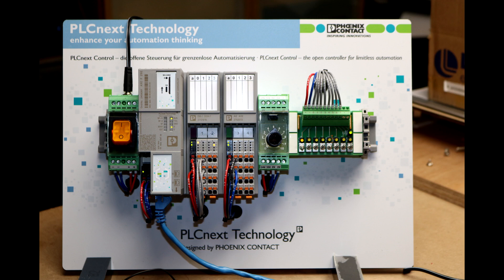We'll look at how to communicate with other products and even heterogeneous ones, such as Node-RED running on a Raspberry Pi, a Modbus HMI device, and a few other things. We'll also look at running the OPC-UA interface, which I struggled a little bit to figure out. When I do that video it will become very clear — I used a Node-RED OPC-UA module on a Raspberry Pi as the client side, talking through secure channels to the PLCnext controller to extract data and write to I/O and analog ports.